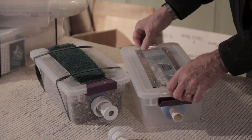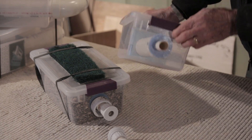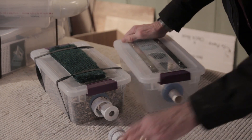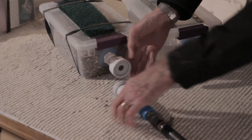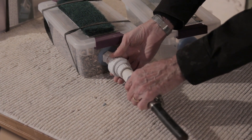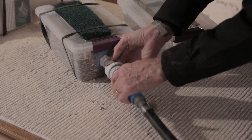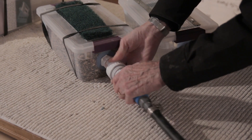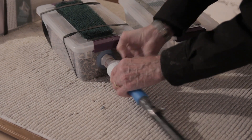This unit is 15 gallons a minute, with all three-quarter inch size fittings. That way you can take this off, handle it, and leave the pump alone — you won't lose the charge on your prime — and just put this back on again. I don't furnish the union; you have to buy that and the foot valve yourself.